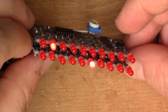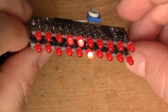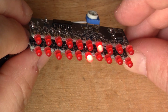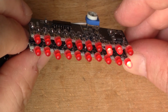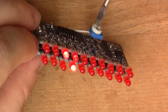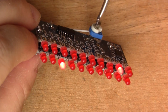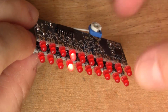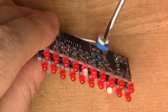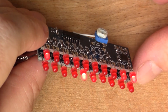That's quite a nice effect — the top board is the original board and the lower one is the divide-by-10 board, so the LED advances at a tenth of the speed of the board on top. We can still adjust the frequency using a screwdriver here. That's the fastest.